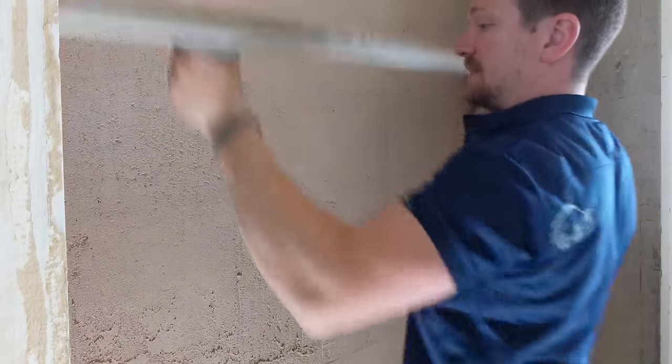I'd leave it another 20 minutes. What I'm going to do is a dry trowel — just using the trowel with no water. And then that is it, the process done. That is how you completely lime plaster a wall. It's not rocket science, and if you follow the steps in this video you will figure it out. Thanks a lot, cheers.